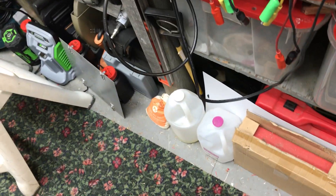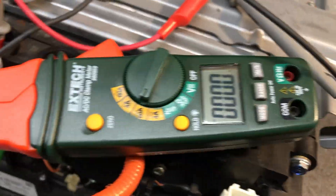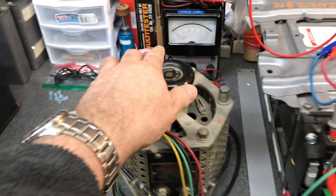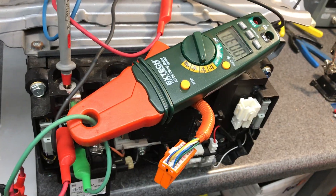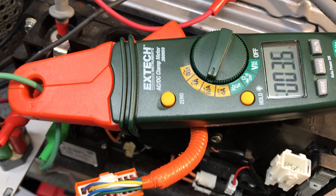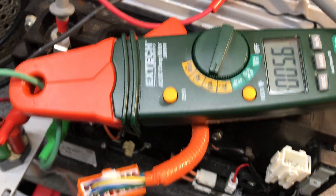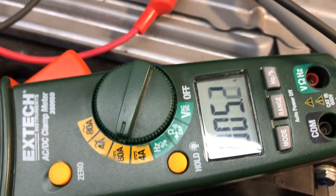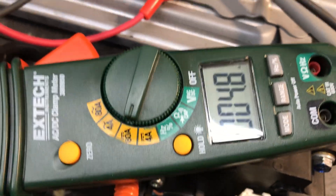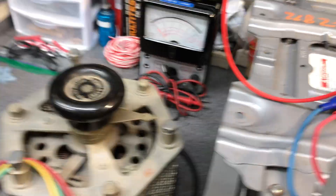I'm going to prop the meter up here. It's 0 amps on the negative side, so I'm going to turn it up until I start seeing current. I'm seeing current — 1.6, 2, 3, 4, 5, 5.5 amps. They're supposed to be 5,500 milliamp hour batteries, so the C1 rate would be about 5.5 amps. Actually it's all the way up — I've got no more headroom left.